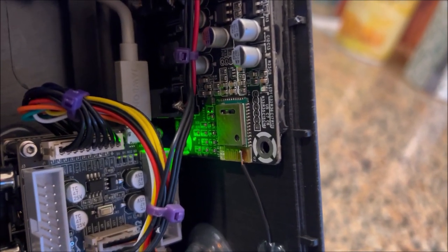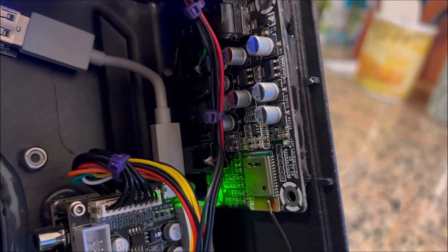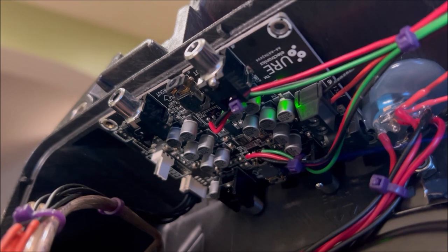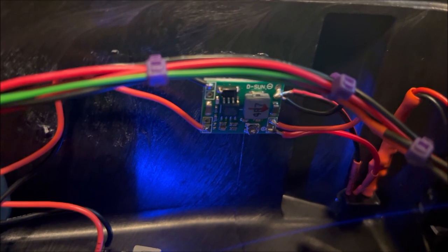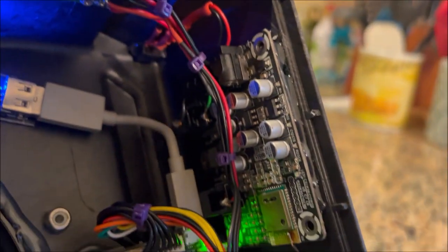There's a Bluetooth 4.0 module — a little transmitter. I have a little mod: it's just a four-and-a-quarter inch solid copper conductor wire that extends the range out to over 100 feet on this Bluetooth 4.0. This is a digital volume control — really good specs on it, very clean, very low distortion. That's all controlled by a small board that connects to the knob on the outside. There's also a 24-volt to 12- or 9-volt converter going to a DC-DC isolator, which connects to both the volume control and the Bluetooth receiver.